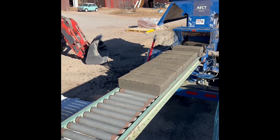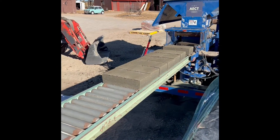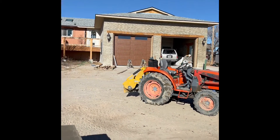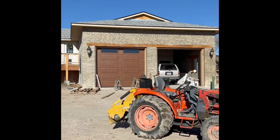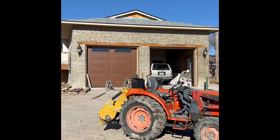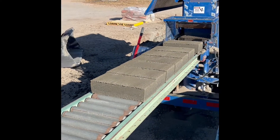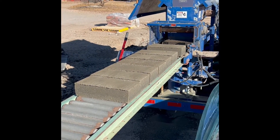We want those blocks that are going to be driven over and rained on and frozen over and over again. They're going to take a little more abuse than blocks in the wall of our garage, which we put a roof on and then a clear masonry sealer on. So those blocks are more or less protected from the weather. Rain can hit them, but it's not going to soak in, versus these blocks laying on the ground, which will take a lot of moisture wicking up, plus rain, freeze, snow, and being driven upon.